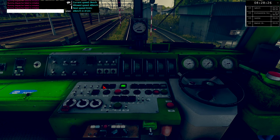Right, it should now be turned off. So if you turn on the compressor too quickly after turning on converter, you might overload it, as you can see. We just overloaded it, and unfortunately the locomotive won't start. So we need to turn off both converter and compressor, reset converter overload relay, and then start the locomotive again. Right, let's go through the right procedure.